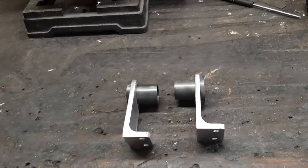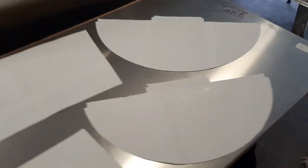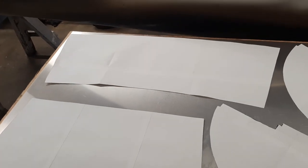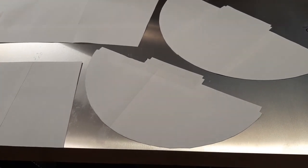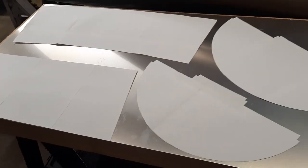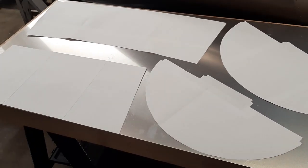Now we just got to make sure the seven-eighths tube goes through the center. Next step I think I'm going to trace out the pattern for the fuel tank and get that cut out of the metal. I got the four patterns for the tank all traced off the plans — the plans were full size — so I just made a copy of them. I'll mark it to cut out four rough chunks of aluminum with the nibbler, then trace it accurately and head to the bandsaw to cut these four pieces out.